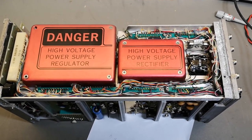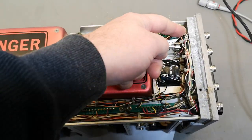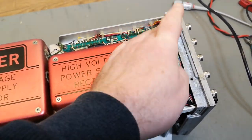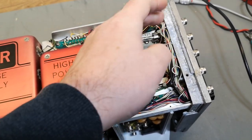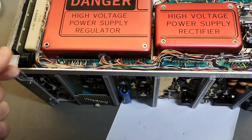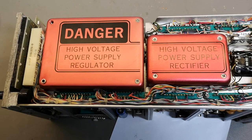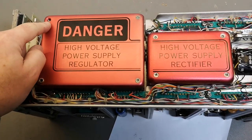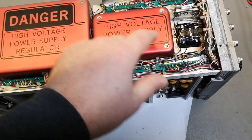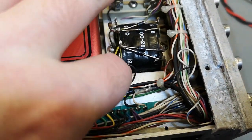It's a beautiful unit, but it was clearly stored wrong — look at all that corrosion. It was more or less outside in the rain. This dust is more or less electrically conductive, so you don't want this going into high voltage areas. There's a screw missing too, which tells me somebody was already in here. But that mains transformer is beautiful — they just put some rectifier diodes right there to easily make some voltage.